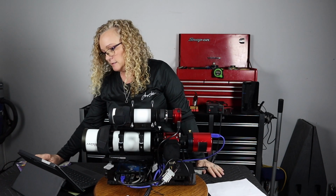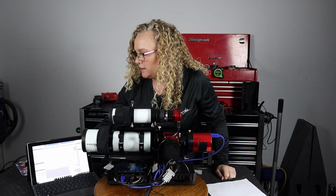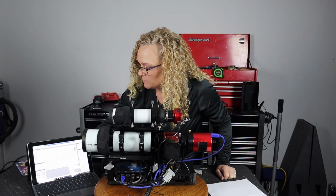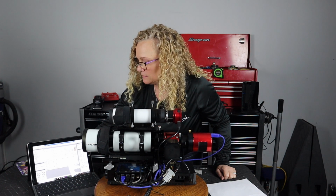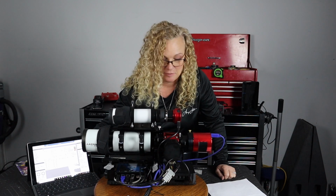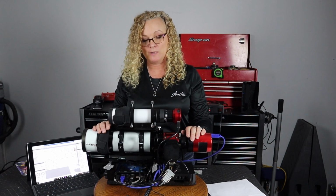Now, let's see if we can get this thing to connect up again. So there's the screen there. So now if I connect the Pegasus UPB focuser, let's just connect it here. And I come over here and I say make a course move of 500. I'll be quiet here. I want you to listen. Did you hear that? I didn't. But you know what? It moved. I could see it moving, I could feel it moving, and it was silent. That is because the pinout is now correct, and there's no fighting between the two.